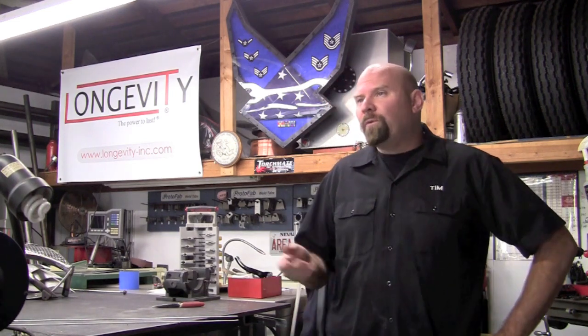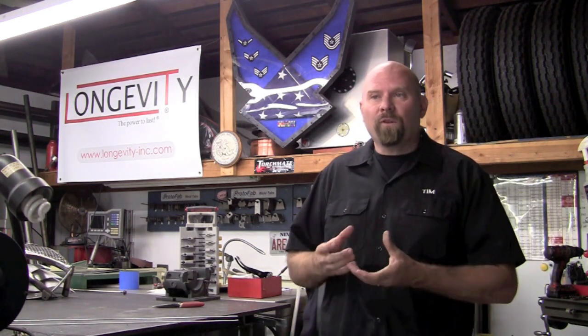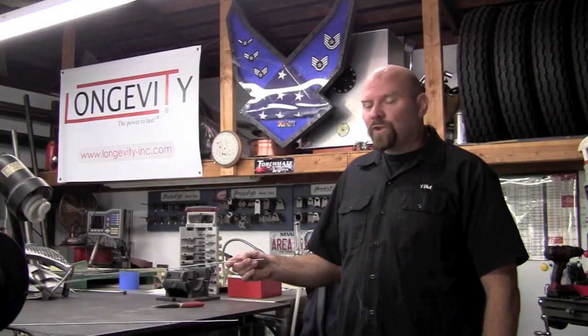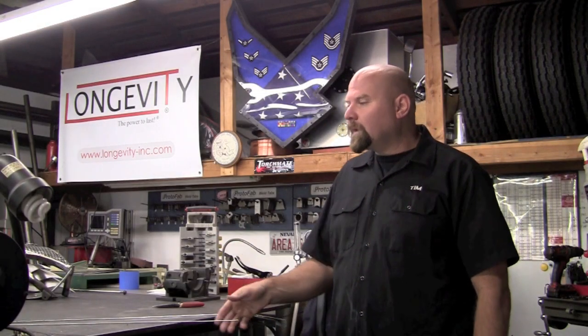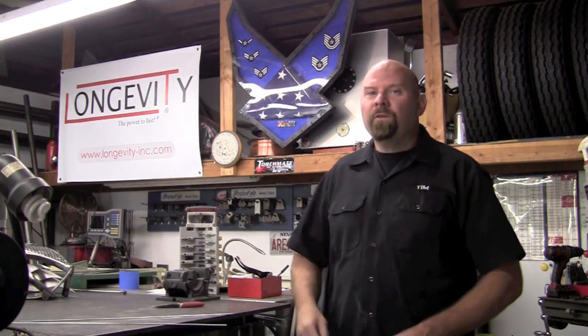What this does is we can just do a kind of a quick drop test on it. With the 4043, it'll just kind of drop into a thud. The 5356 will have a ring to it, because it has the magnesium — it's a little bit harder. So we'll drop the first one, and then we'll drop the second one. The one that you hear with the obvious ring, and it actually does a couple more bounces, is the 5356. So that's one way to identify it.